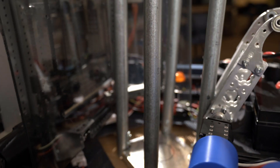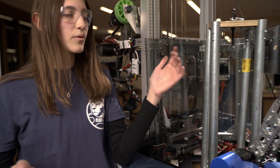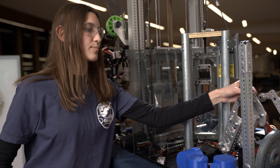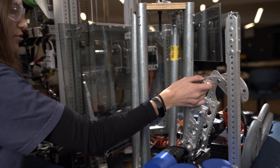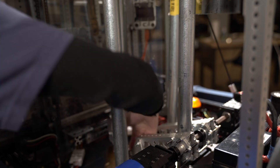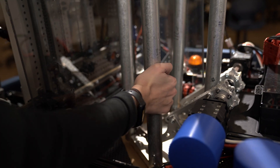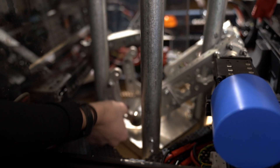When the robot finishes the climb, we wanted a way for the frictional force to come back to keep it up. So we added these brackets — as it goes down, it sits on the brackets and the force is then transferred here.